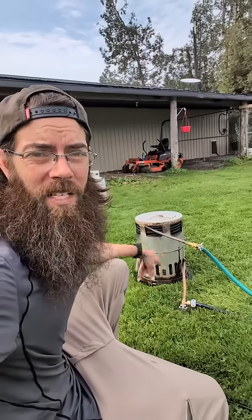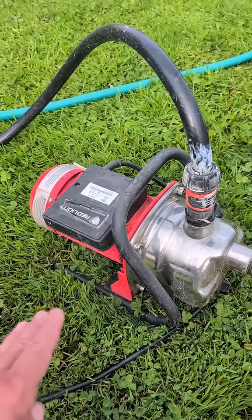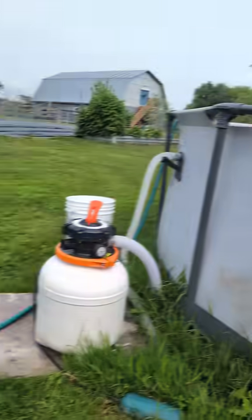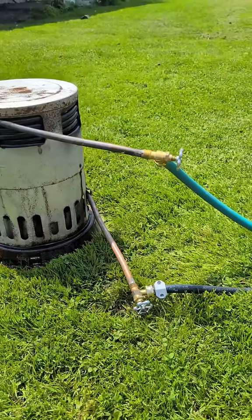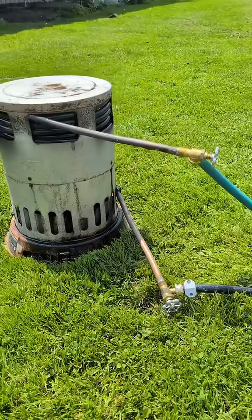Yeah, I know, I called these ball valves, and they're not ball valves, but I don't really care. I'm using this red line pump to suck the water from the pool to go into this heater, which ends up going back into the pool. So the reason there are valves there in the first place was so that I could slow down the flow of the water and keep the water in the coil longer. I've since learned that more flow is better than hotter water.